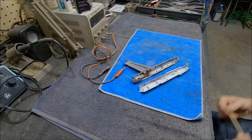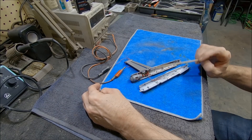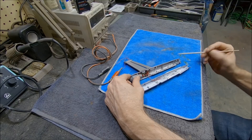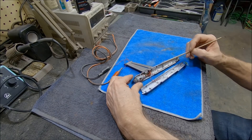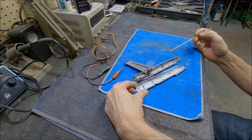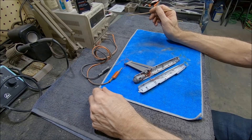Back again, everybody — made some good progress. Got all my wires tucked in and the harness put together with a little zip tie grouping the SMD wires coming off the motor. Got plus and minus coming in on two separate lines — one for the lights and one for the motor — with everything sharing a common ground on one wire. The 5mm blue LED at the back has a 470-ohm resistor; the two side marker lights share another 470-ohm resistor. Wires are all CA glued down to keep them from getting in front of the grill. Motor polarity verified so it's spinning clockwise for the correct side of the ship.